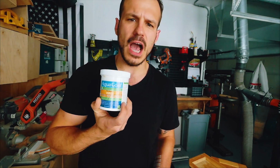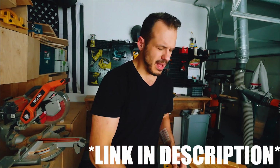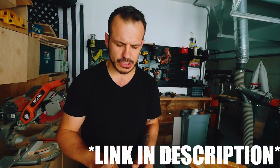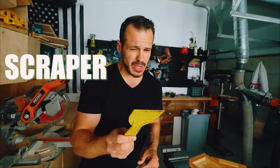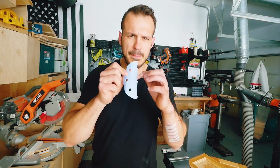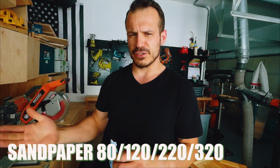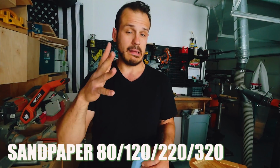So in order to accomplish this project, we're gonna need a few supplies. Number one, the main event, the Aqua Coat. It's a clear wood grain filler. On Amazon, I think it's like 20 or so bucks. You need either a squeegee or a scraper, or even a credit card, an old one. You need a rag and sandpaper. You'll need 80 grit, 120 grit, up to 220, and then for the finished project, 320-ish.